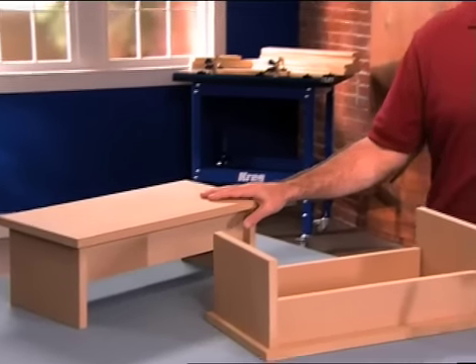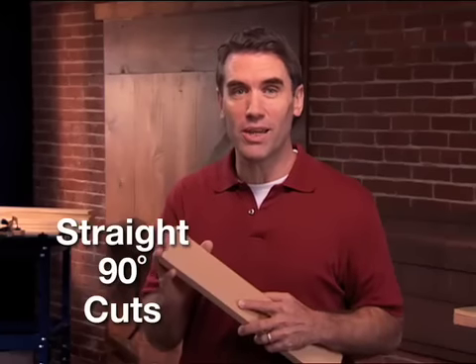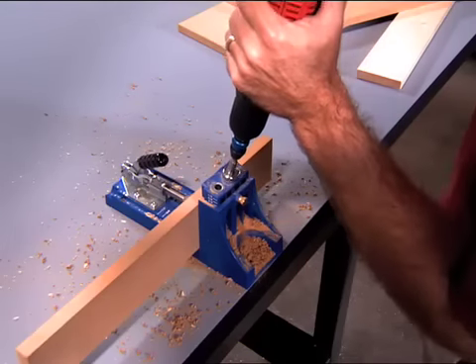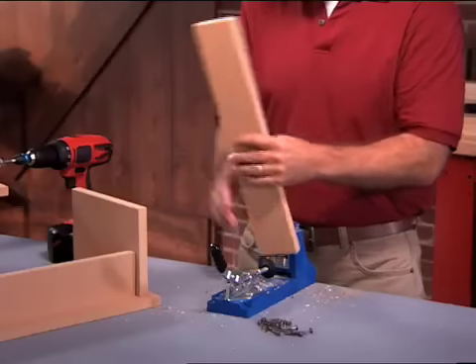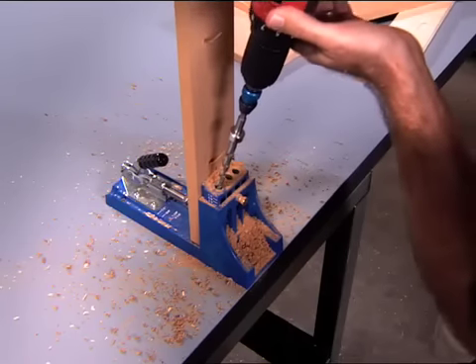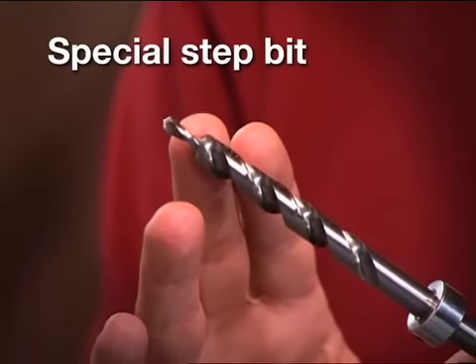This stool is a simple project to build with Kreg joints. A bit earlier, I cut the pieces, and you can see they all have square cuts. There's no need for complicated cuts to make a Kreg joint. I just simply drill holes along the edge where they'll be joined. You don't have to worry about spacing these holes exactly — just put them about six to eight inches apart. The hole you make is Kreg's pocket hole, created by this Kreg drill bit, a specially manufactured step bit that drills the pocket hole and the guide hole for the screw at the same time.